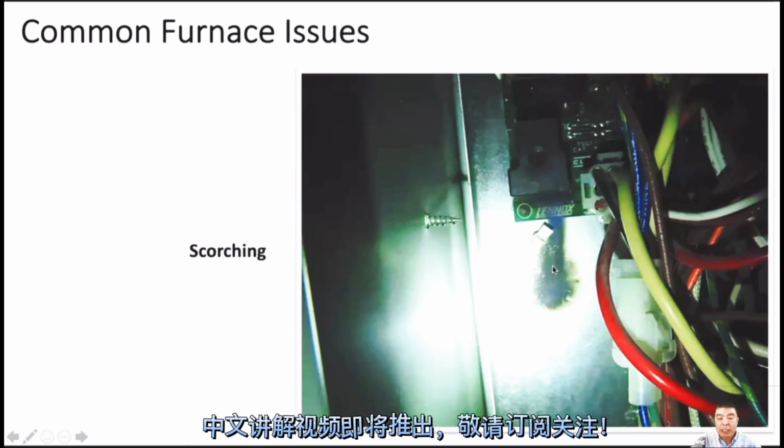If you check the condensing unit outside, if you take the cover out, maybe you can see the metal scorching like this. This means we need to recommend maintenance and repair. Sometimes it's the spark that causes trouble, and sometimes it's shorting or corrosion, or maybe there's a fire hazard there. So if we see something like this, we should be mindful and make notes. Just let the customer know. This one is maybe very old, or maybe not operated right, so it should be checked, repaired or changed.